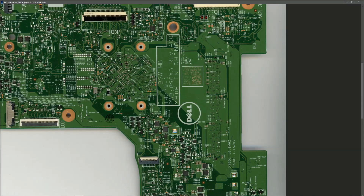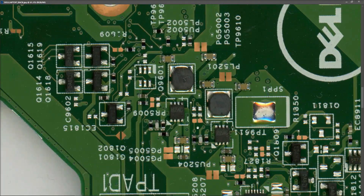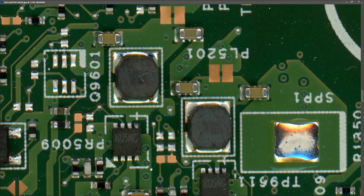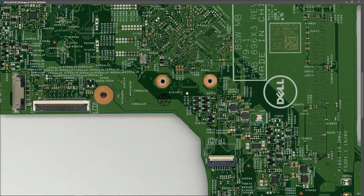After scanning in the motherboard I did a quick visual check around the board to see if anything was blown, and I couldn't find anything obvious. The only unusual thing I noticed was these two inductors right here — it looks like there's a crack along the line on each of them. I haven't seen that before on these boards; excess heat can crack them. I tested them with a multimeter and they test good, so I'm not exactly sure what's going on, but that's the only visual anomaly I found.